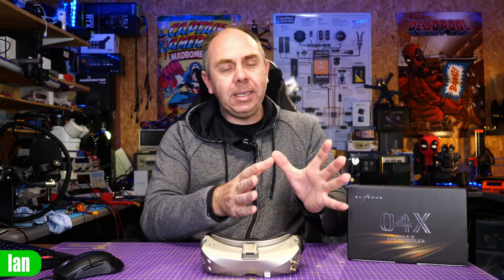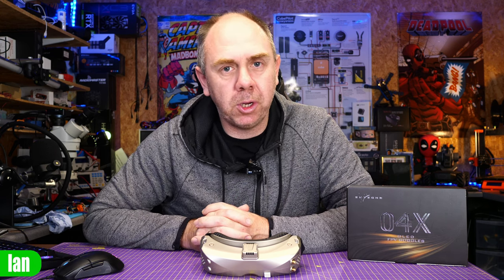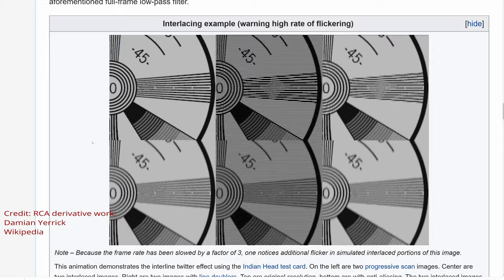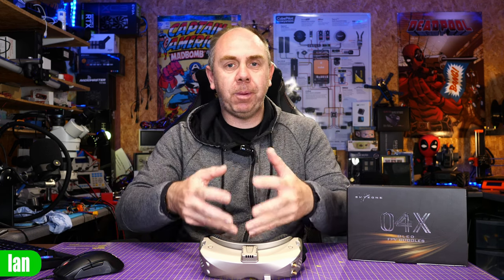To display interlaced data on digital goggles things get complicated and there really is no perfect or simple solution. You could combine those two fields being transmitted into one frame and display that on the goggles, which is pretty much what's being done here — but that has an effect. You are combining two fields from two different points in time, because a field is scanned and then the next field is scanned — they are actually two separate moments in time. The effect of that can produce what is known as combing or a ghosting effect around the image. Also, as you increase vertical resolution, you can get an effect called twittering. That twittering is the effect I am seeing on the display in the goggles — like a fuzz or movement of the image, an aliasing caused by the two fields being combined and displayed.